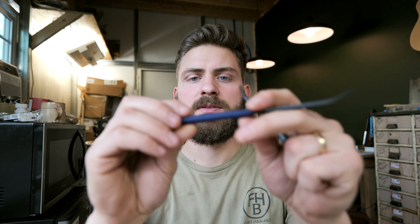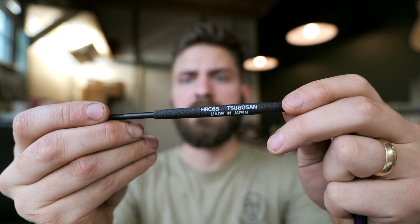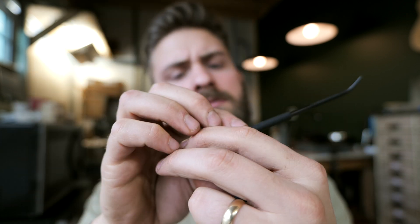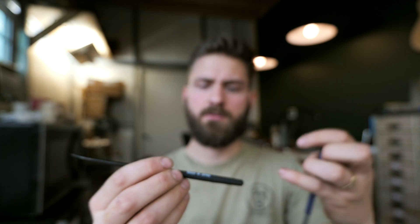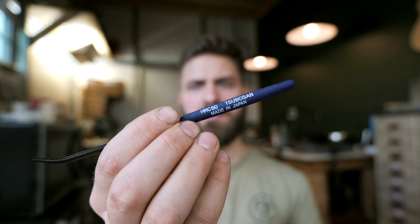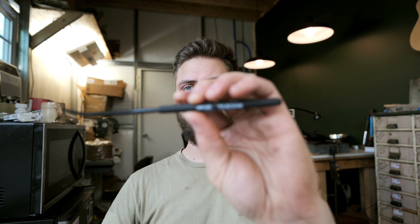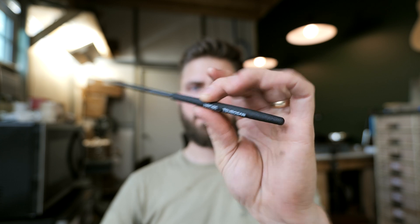You want to be somewhere in a certain range. This is the 60 Rockwell file, and this is the 65 Rockwell. You kind of want to be somewhere in between these two. The idea is that if you are at or above 60 Rockwell, then a 60 Rockwell tester is not going to be able to bite into that steel nearly as much as if it's like 55 Rockwell. Then the 65 Rockwell — if your blade is at 60 Rockwell — the 65 should be able to bite into it. So it kind of tells you where you are.